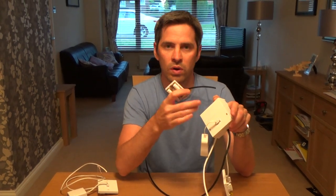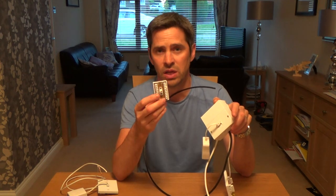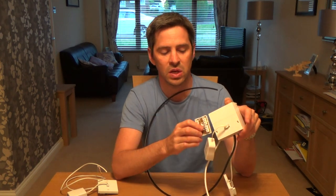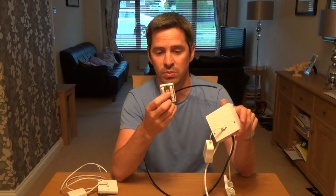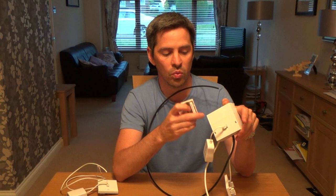The rule is you only put two wires in each IDC terminal, but this could be a problem because you might want to run three wires from the master socket. If you had loads of extensions, you wouldn't want to cram more and more in here — you would just fit something like a BT-78 next to the master socket. I've done a video on that already, so you can attach numerous extension cables onto it and then just have the one wire from there into the master socket.